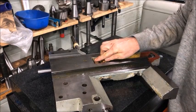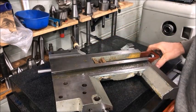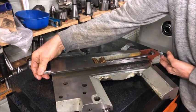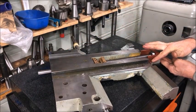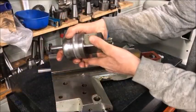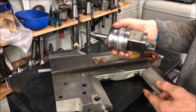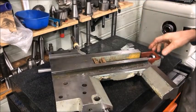At this stage you may run into some alignment problems. You may have to shim the nuts on the top, or rearrange the screw position up and down to avoid binding, and also reposition the alignment holes in the front. And then you have the gearing towards the saddle for an automatic cross-feed. But luckily, in the end, this did not become a problem, so I didn't have to do anything.